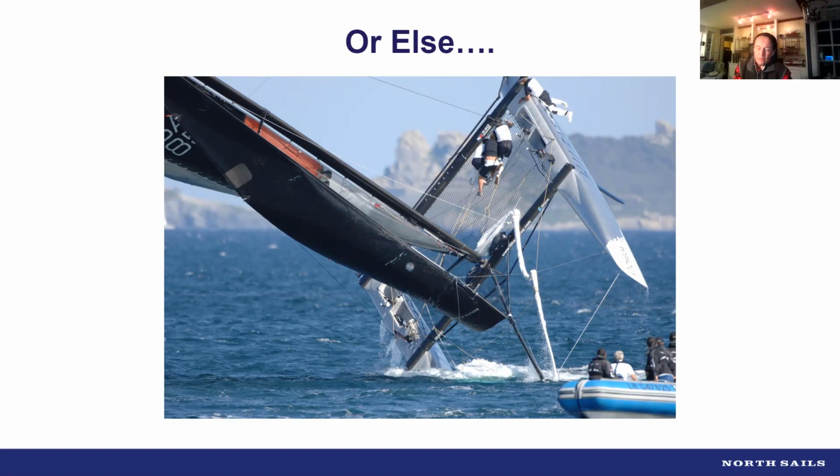Yeah, I think that we touched on this earlier today when we were talking to you guys, that the older, heavier displacement designs I would say appreciate the larger, older style Gennakers, and maybe you dip down into a code 0 or a code 65. If you've got a more current and a more high performance boat, then your two downwind sails, if you're going to have two, might be a code 65 and a code 55.